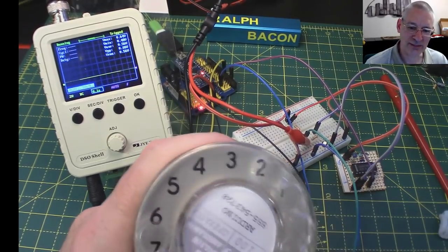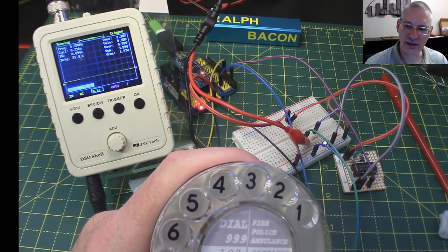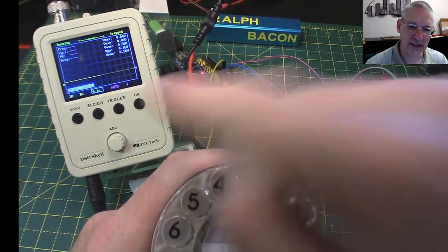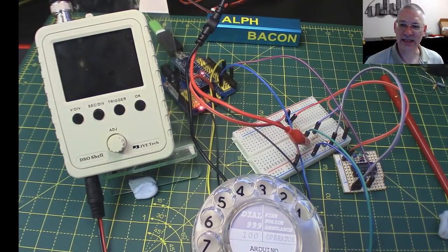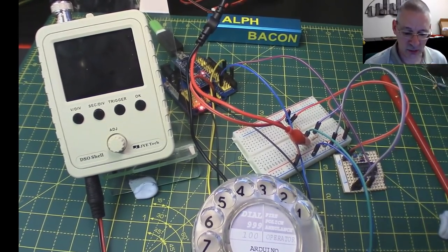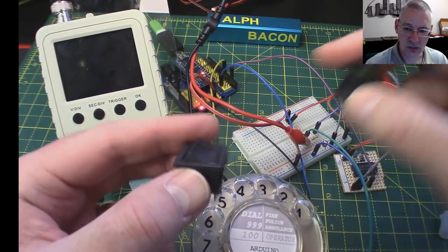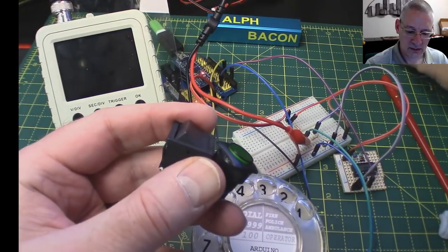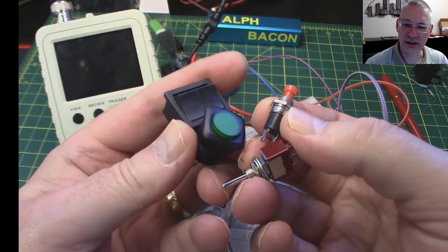But it's not the shape so much that's the problem, actually. It's the noise around those switches, which we can't see on here. It would be asking too much of that JYE to actually give us that detail. But I can demonstrate what switch bounce looks like very, very easily just by using the scope I've got down in the workshop and using, say, a switch like this or like this or indeed any one of these. They all exhibit switch bounce to some extent.